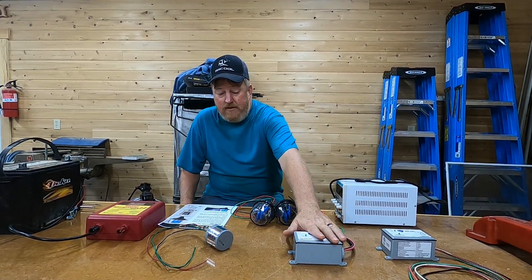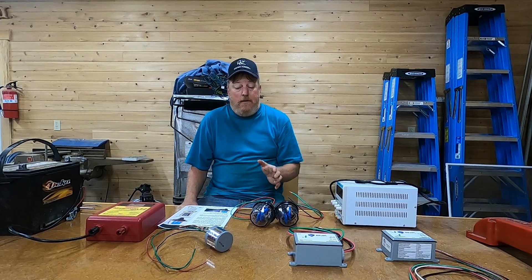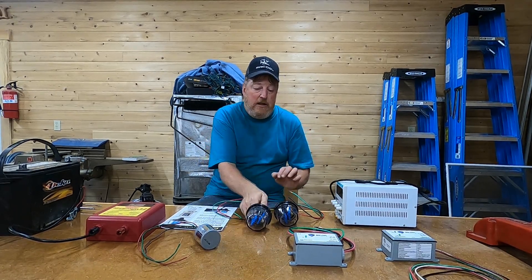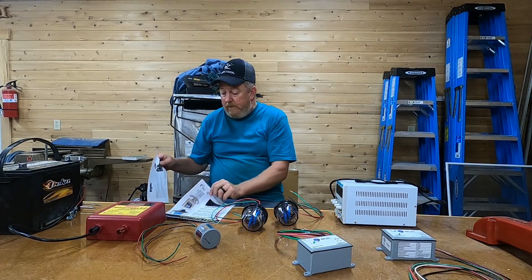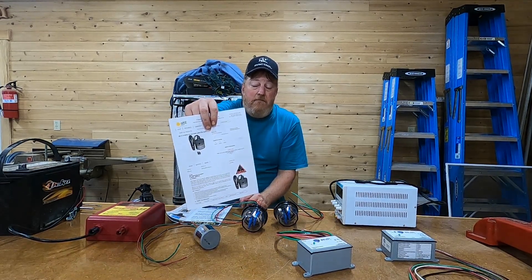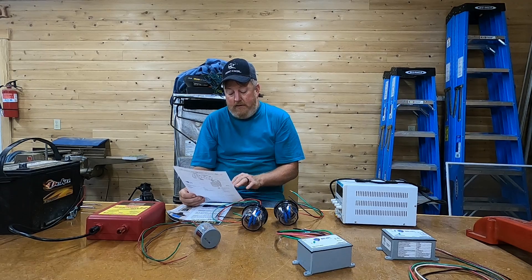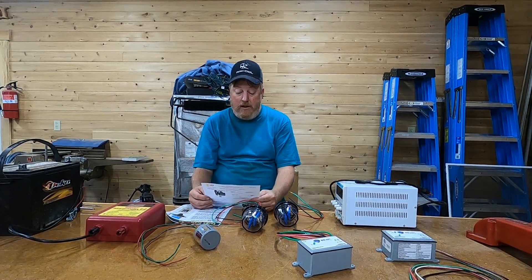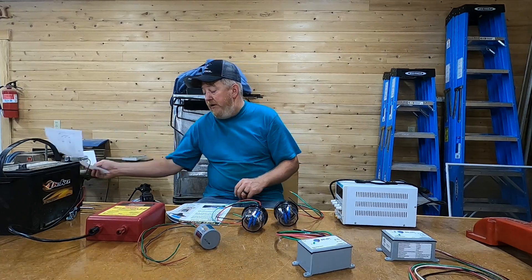I suspect the EMP Shield is a quality product, but I think they may be doing a little scare tactics in their marketing and it's extremely expensive. You're probably looking at about $80 for the Midnight, about $100 for the EMP Shield, and about $350 for the AC version on the street. The Delta arrestor is actually about $42 street price — so you can go to the beach and get some sand cheaper than that. Their marketing is very good. They talk about this being silica-based so it acts quickly, but they don't really talk about what it can handle. They say it can handle 60,000 amps — that's really all they say. They don't talk about surge ability or anything like that.